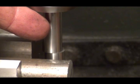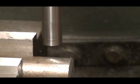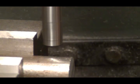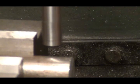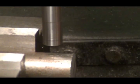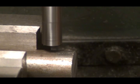The edge of the half-inch edge finder is right against the edge of my round. So what I do now is come up and move my material over a quarter inch. Now the centerline of my drill or my mill is even with the edge of that one-inch material. I zeroed again because now I'm right on the edge and I want to come in a half inch — that's five turns. One, two, three, four, five. Now the centerline of my mill is exactly the centerline of that one-inch material.